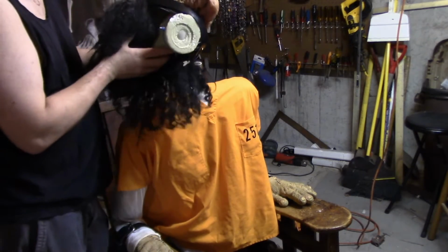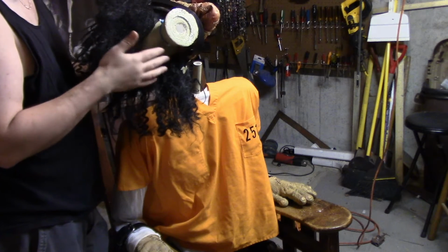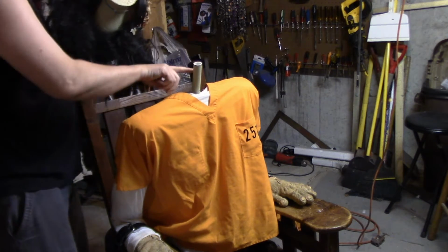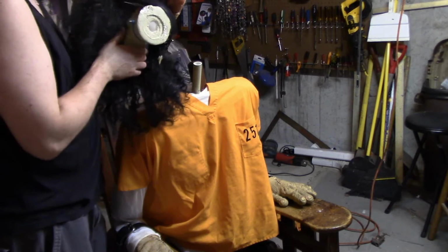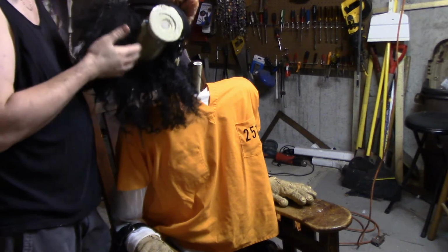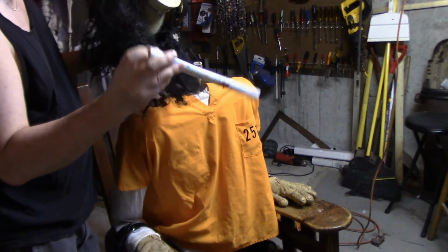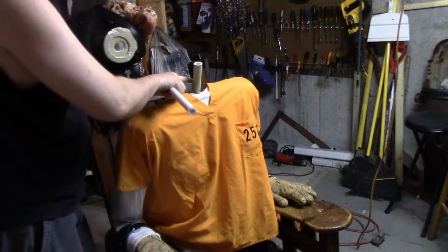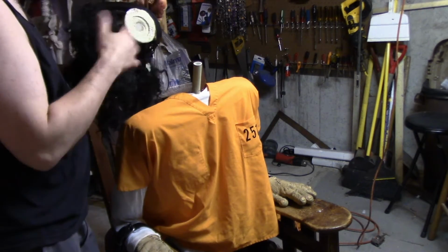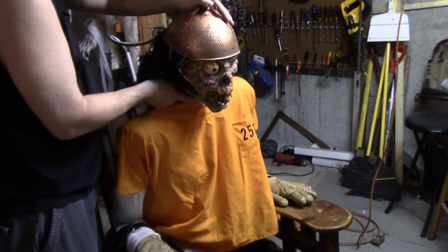So what I'm gonna do with this head also to keep it stationary is drill a hole in the back and then put in some kind of plastic tubing or something that will allow the screw to go through, maybe a screw with a washer, and then I can screw right into this PVC, and hopefully that will hold the head stationary while not eating away at the foam here, not making it chip away as the thing does motion. Imagine like this, if I had a bolt this big, shoving that in there, putting the screw through there, and then having that go into this. It only has to be this long, right to the center, to make contact with that, and that allows me to easily take this thing off when I need to service it, which at this point looks like it's going to be a lot of times. I hope not.